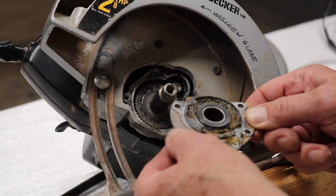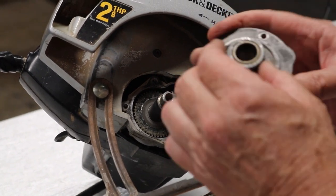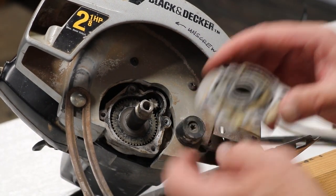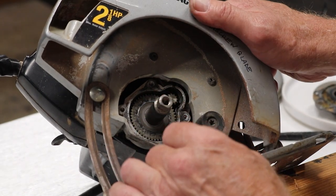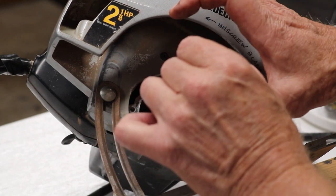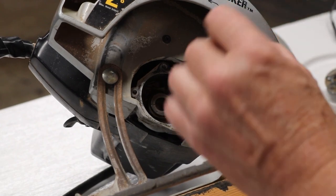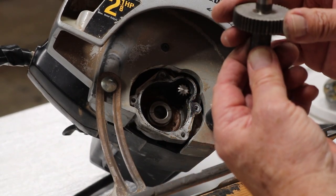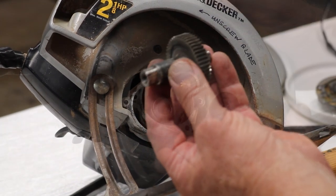The first indicator is that this grease is all dried up — it looks dirty and bad. We're going to have to clean that up. The sleeve bearing here looks like it's in pretty good shape; it's replaceable but I'm assuming that's not the problem. This is the main gear — the blade gear — and it's driven by the pinion gear on the motor shaft, which is the small gear here. The motor is geared down, so it runs a lot faster than the blade itself. This thing looks in pretty good shape except it's dry as a bone.